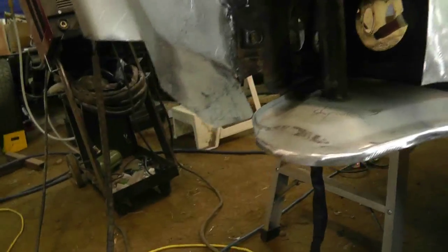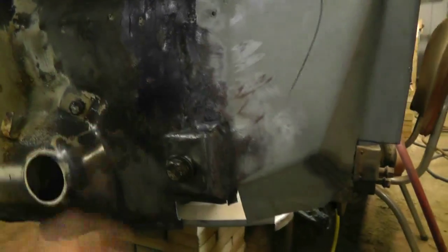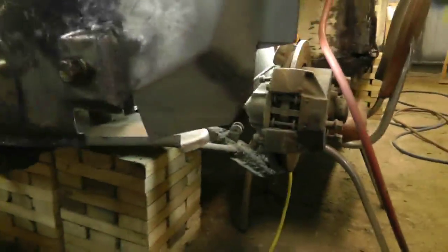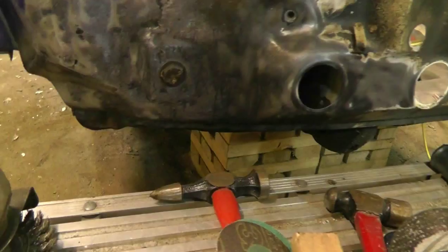What I was going to say is I still noticed that there's still some voids up here that I got to deal with. So I got to weld that up, but I think what I'm going to do before I put this piece on the back side is I'm going to sort out this front side here, because the way that those two pieces come together kind of influences each other. So I'll try and reproduce what I did over here, and then we'll weld that back piece in. The objective for today is to get this piece in and that piece in.